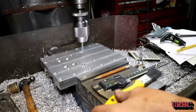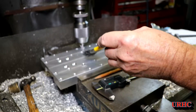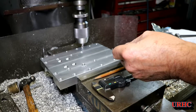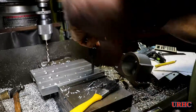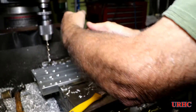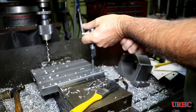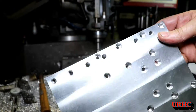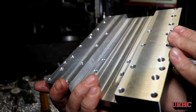Then I started on the next plate for the Z-axis - same process, starting with center drilling. I'm putting in a series of M8s for the spindle mount. The worst part that takes the most time is going back and tapping everything. That plate is all roughed out and ready to go.